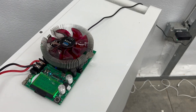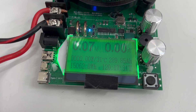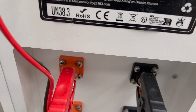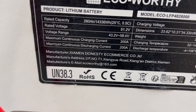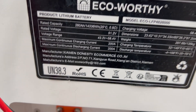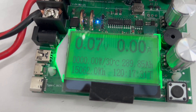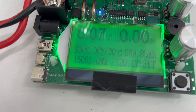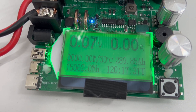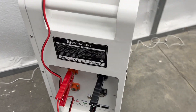So this is finally done. I've actually been working on a bunch of other projects, so I've been kind of busy. But I've been having this thing running for quite some time, and the capacity is actually better than what I thought it was going to be. So going through the specs: 280 amp hours is what we're supposed to have, at 14,336 watt hours. Here's what we got: 15,062 watt hours and 289.85 amp hours. That is pretty damn good. So quite happy with it.